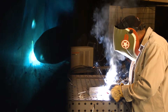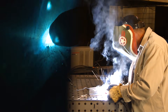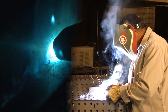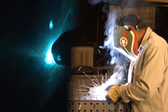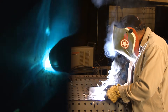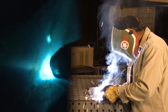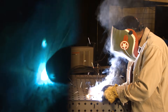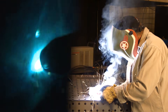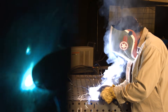What I'm looking at while making this weld — the main thing is width. As you can see, it's putting out a lot of smoke and a lot of sparks. I'm watching right behind where the wire is, with a very slight oscillation. That wire is dancing around a little bit, a little unstable, and that's normal. I could probably go up half a volt or a full volt and increase the wire speed.